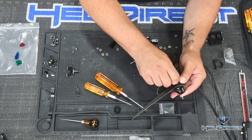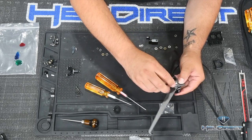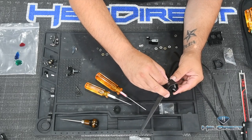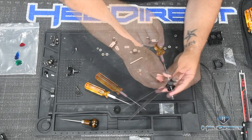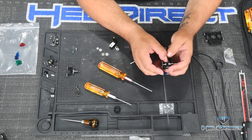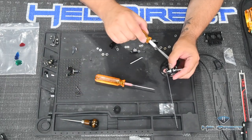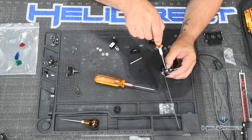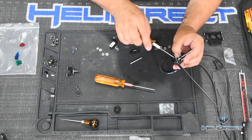So really, once I removed that other bearing, it wasn't so bad, because you can kind of lift the tail pulley into that cavity and get the shim under it. All right, now we still have to set the set screw again, which I'm actually going to remove so that I can see the recess. And hopefully that red Loctite hasn't set too much yet. I don't think it has. Nope. Still comes out easily.